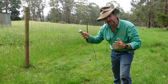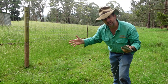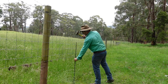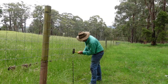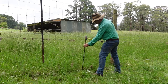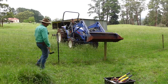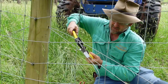So it's a simple plan today — we're going to use the medium-sized ground anchors to pull this post back down into the ground, where you can see it's risen up in the middle of this water-soaked gully. The process is really simple: drill a hole through the post about a meter above the ground line, then ram in a medium-sized ground anchor about a meter and a half away from the post in line with the fence on each side. Push the post into the ground using the bucket of the tractor, and then secure the post to the ground anchors using the hole to form a sort of an A-frame sling.